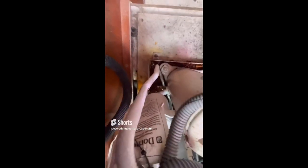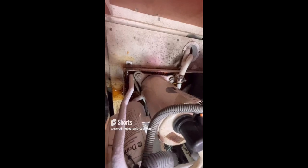For today's find, we've got to do a little detective work. We see a lot of running rust here — where is it coming from? Remember, running rust, leaks, and stains are your boat's way of telling you something's going on. The storage locker above this bilge contains the air conditioning unit, which has a drip tray to retain condensation. This drip tray has rusted through — there's a hole right there — and that's where the rust and stains are coming from, draining into the bilge.